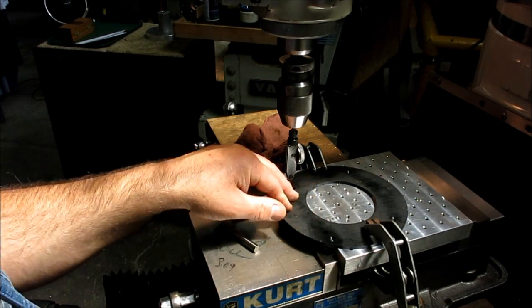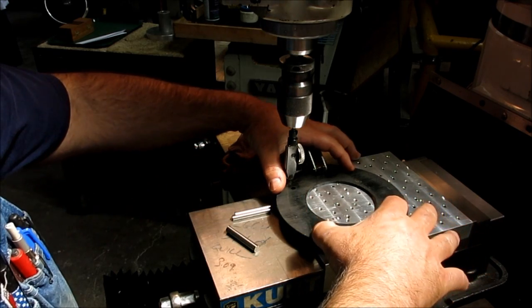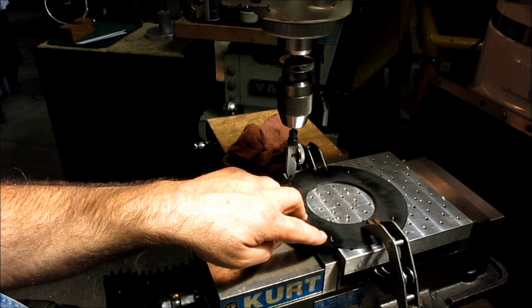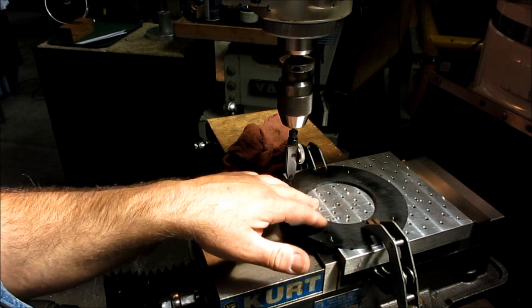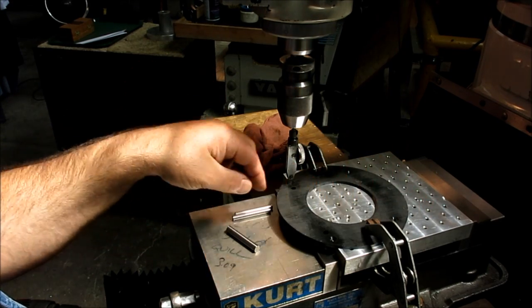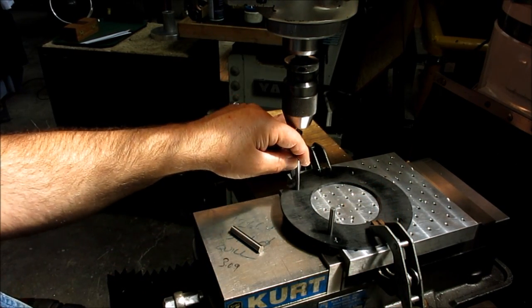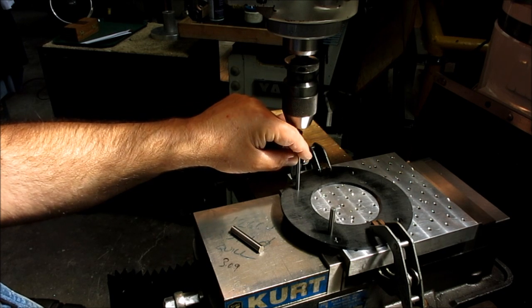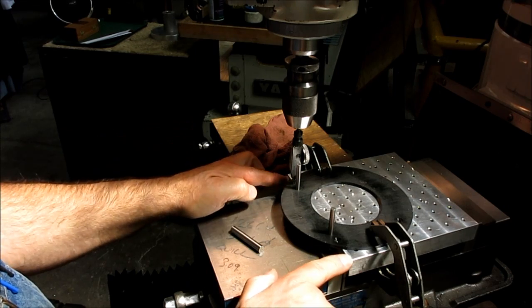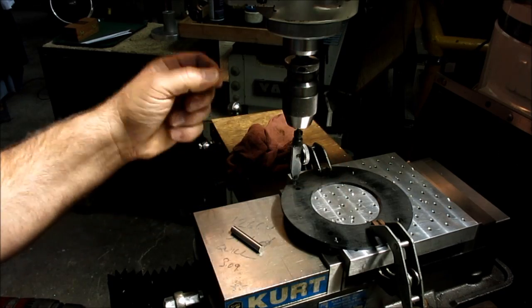Okay, so here's the router plate problem. And this is the oddball hole centers on the bottom of the router. And they're flathead screws, so we want to pick up these locations accurately. So what I've done, I got the mini pallet here, and then to square it with the world, I used a couple of gauge pins here, let me slip that in there, and I shoved it up against the edge of this to square it with the world, okay, and then I just bumped the indicator there,